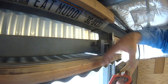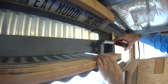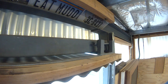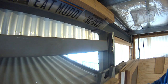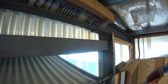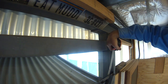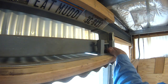The door itself — the structure — is rectangular hollow tubing, 40 millimeters by 25 millimeters. The way I was able to maintain head height but keep my wedge is that the actual roller is right here, rolling in this track. I had to inset it so that the center of that wheel is 80 millimeters inside. It might wind up a little bit different in your design, but by doing that I was able to maintain good head height.